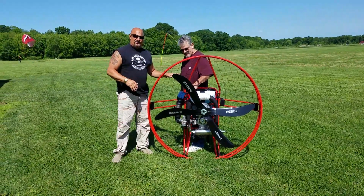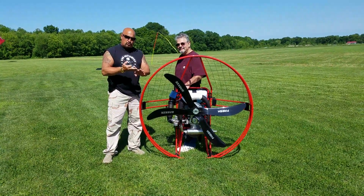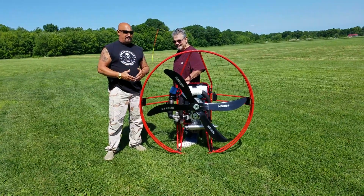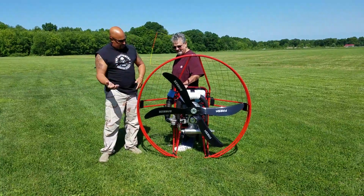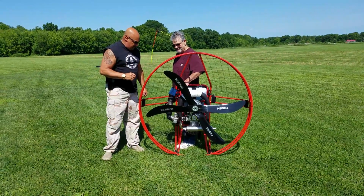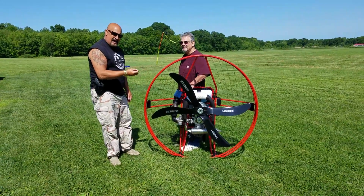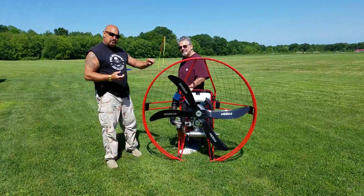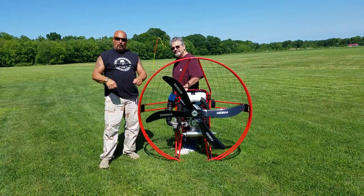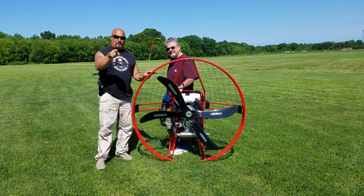Now, this thing has a lot of things that aren't found on the other brands: high performance roller bearings, reinforced crankcases, triple jointed exhaust, bigger motor mounts, float bowl carburetor. It's got internal decompression, intake silencers, exhaust silencers, prop hub stabilizers, and a whole list of other things not found on any of the other brands. This carburation system is not a diaphragm, it's a float bowl carburetor, which means even if you shut the fuel off, there's still a bowl of fuel in the carburetor, and it can start up just by pull starting it. We also have a high energy ignition system that's not on other brands.